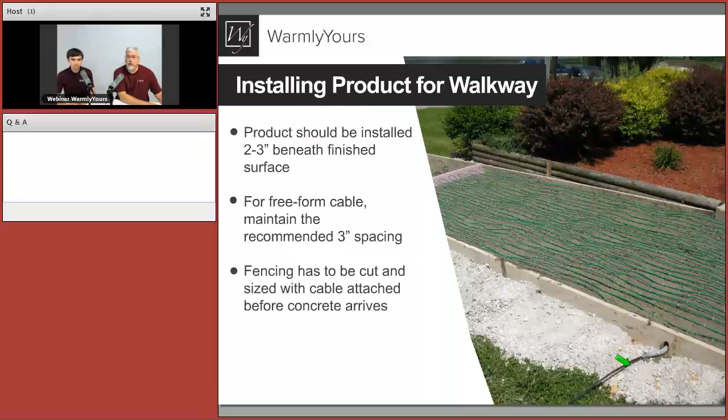Now, what we don't see here is that this is eventually going to be placed into another conduit, and there's going to be a junction box over here. They just didn't have that part done yet. So we have the cable coming out. This will then be attached to a piece of conduit, which will run over to a junction box and is always protected. If this is installed correctly, you will never see this wire again. This wire will be in conduit, buried, going over to a junction box. So that's what's going on here with this drawing.